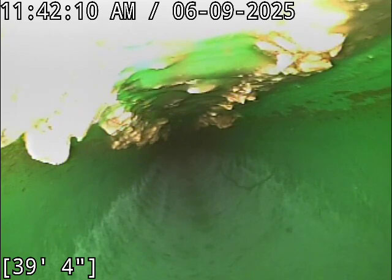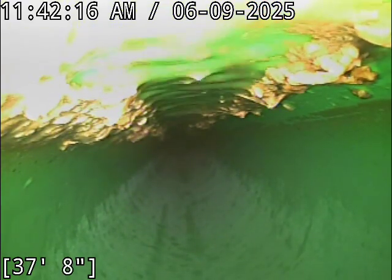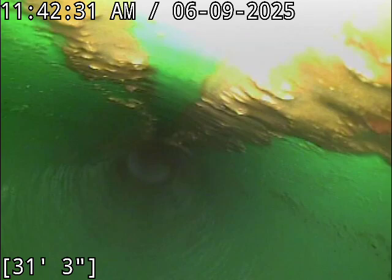And then you can see what else is collecting there. It's not just grease. You've got toilet paper, bits and pieces. So that's kind of the issue. When you flush the toilet, especially these low flow toilets, rarely does your debris get from point A to point B in one shot. And so when it stops, if it stops up in a layer of grease, that toilet paper just gets glued to it. And over time, it can cause just layer upon layer to build up in the line.